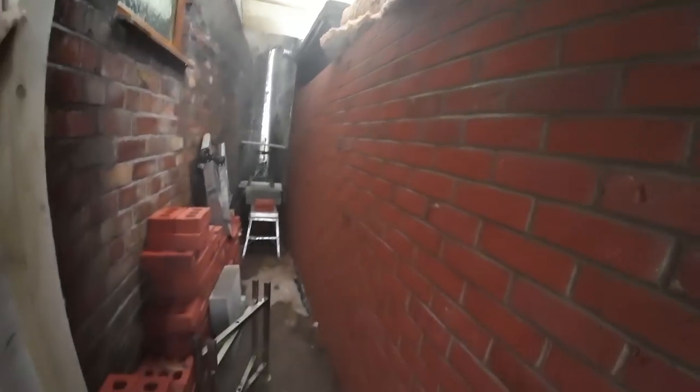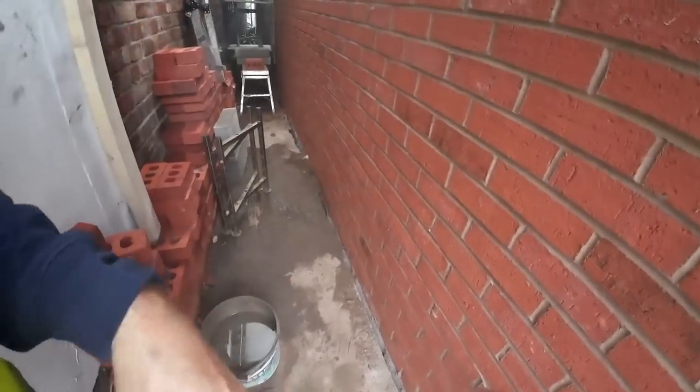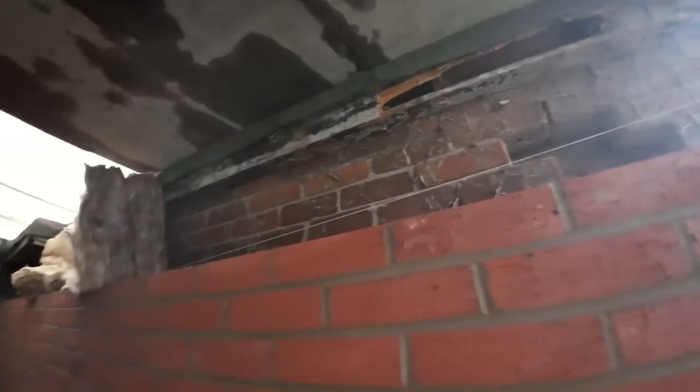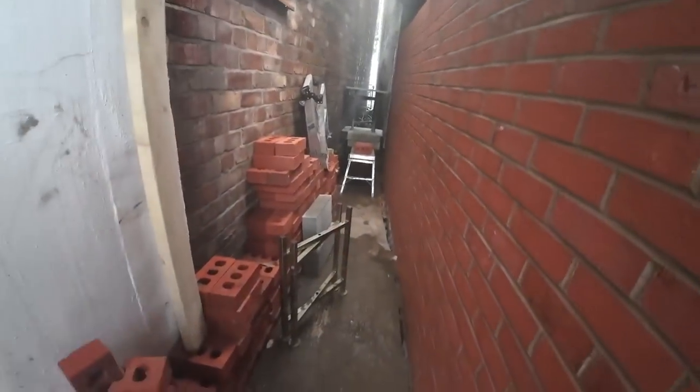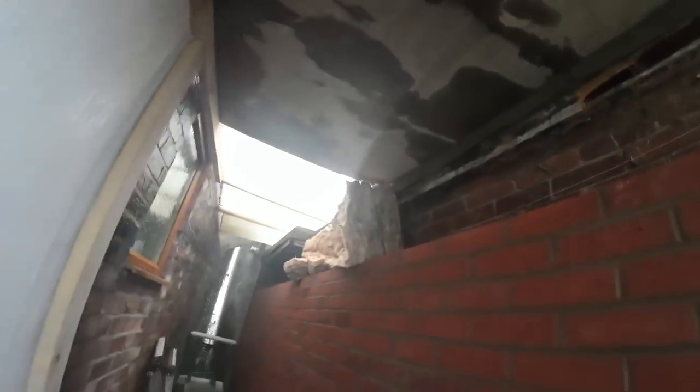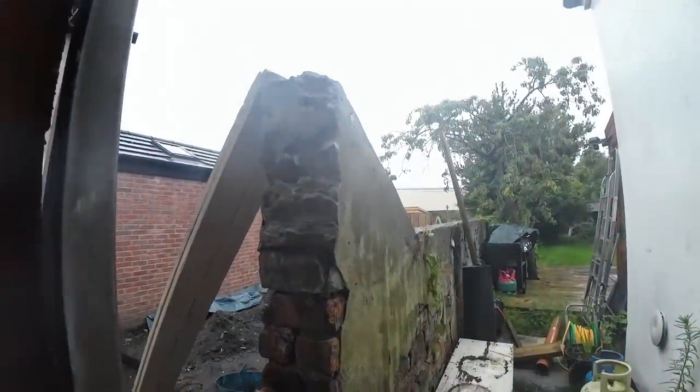So yeah, Alex has got a hop up inside, so we're going to have three hop ups, 1, 2, 3. I've got two planks, and then we're just going to have to build the bricks up in high stacks so we can reach them. There's only 125 to go, 5 courses. So I'm going to get organized here. And now it's going to get the mix on. And feeling quite smug being able to work in this weather, because it is lousy today. It's just been bombing down before.